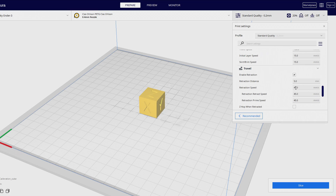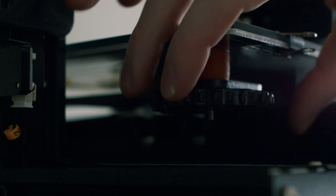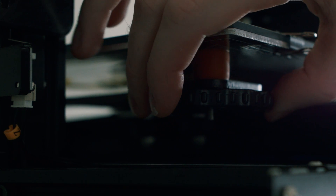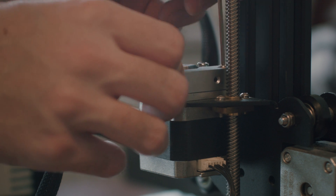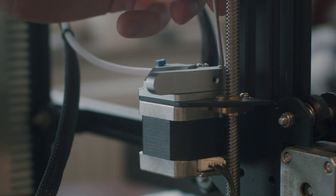I'm not going to deny it — my experience has been far from plug and play. It has required a lot of tweaking with the settings and some hands-on tweaks on the printer itself. Things like re-leveling the printing bed, cleaning the nozzle, some upgrades to the printer, and so on. Of course a newer printer with more features, such as auto bed leveling, will be more plug and play, but you should be prepared for some tinkering.